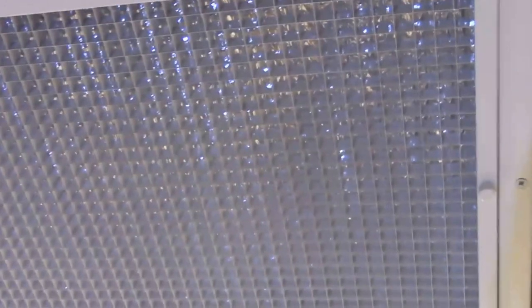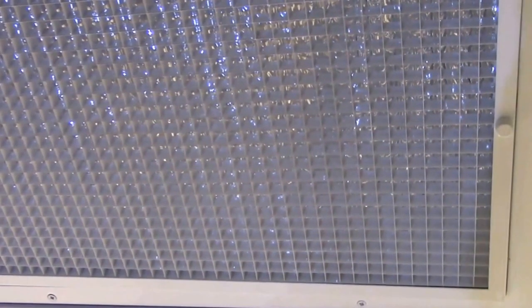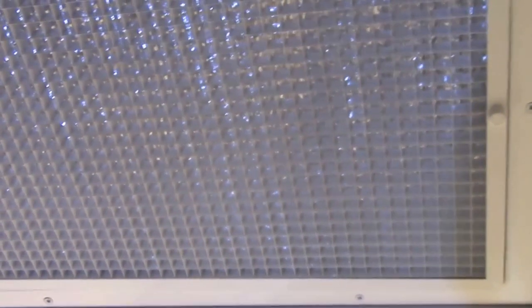I can shut this up and screw the retainer in place, and now I've got a sealed-off, insulated air return. If I ever need to turn the furnace on, I just pull that out and slide the filter in. The fiberglass is only about R4 or R5 — not super high insulation — so this reflective foam helps reflect heat back down and also keeps air circulation down.